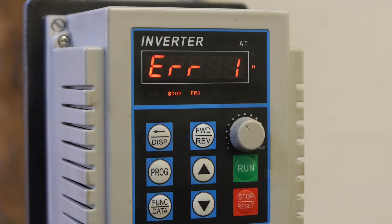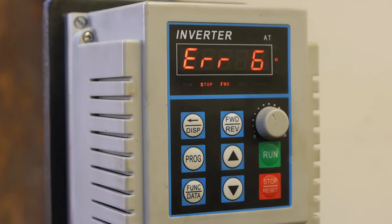It takes a minute for the capacitors to unload. Switching it back on and switching on the motor — same error. That's not good. I set the torque compensation to 50 and tried again, but now it cuts out with error 6, which is an over-current protection. That's kind of weird for a motor that isn't pulling any load.